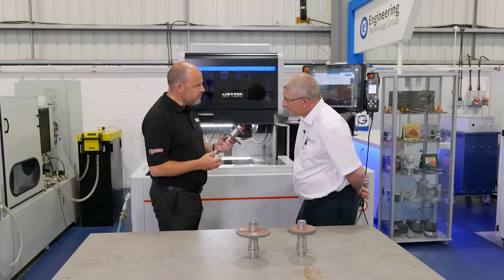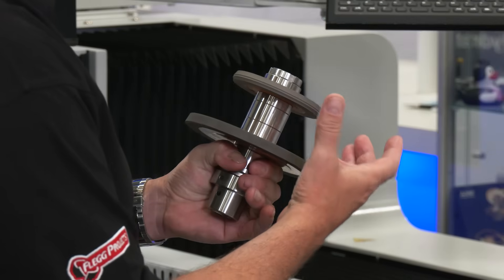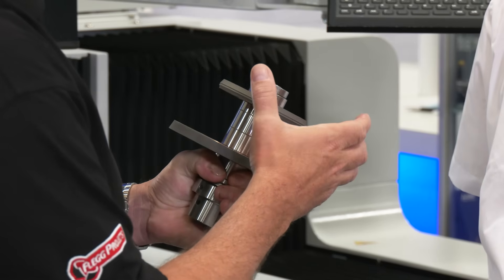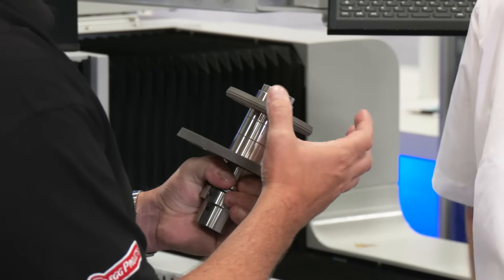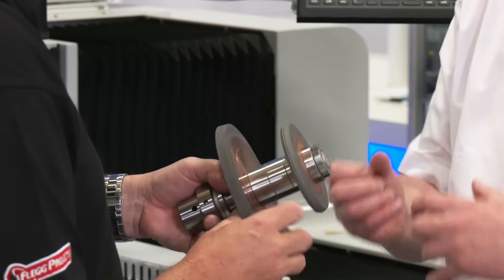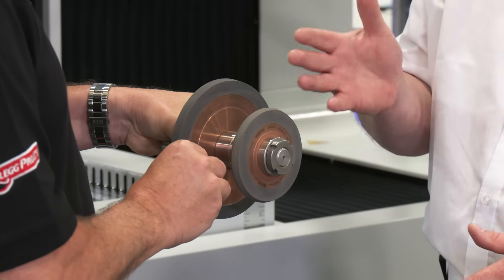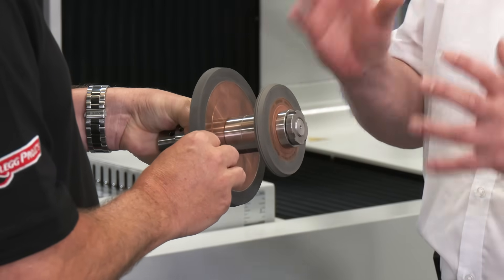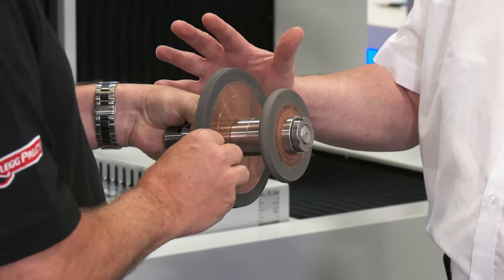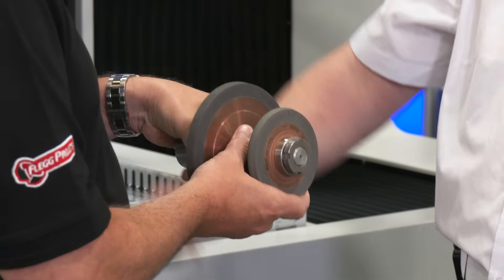No, I was quite surprised. By the cutting method and the fact that it's a much more open environment, there's less stress in there, so it's less brittle — less likely to smash. And because the pores are more open, it cuts better. A recent installation — the biggest thing for them was, Scott, you just wouldn't believe we've not broken any wheels. And we're normally breaking one wheel per week across all the different machines, and there's a serious number of machines.